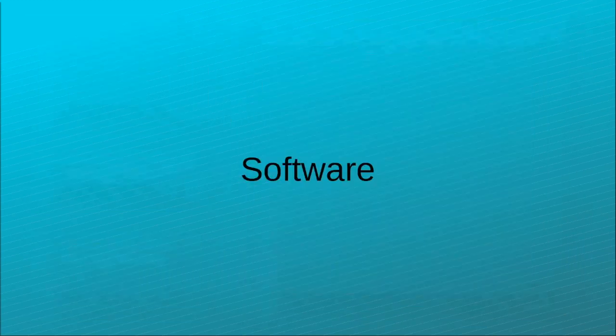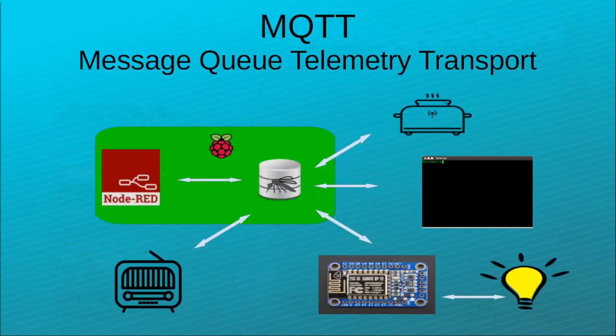All right. Now we get to the software. Now, MQTT, this sits in the middle. And I will explain why I'm listing these little things later. You use these all to put together. But MQTT, it sits in the middle. It's a broker, a message broker. And all it does is just sit there and allows you to publish messages and subscribe to messages. And I will explain this entire diagram a little bit later on.